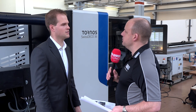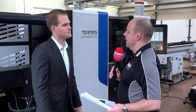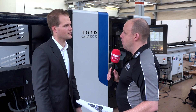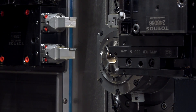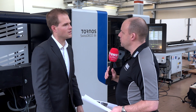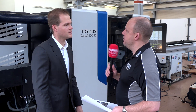You can also put up to four cross tools on the back operation as well. When developing that back working operation, you actually used one of your spindle motors from the main spindle for the driven tools on the back working, so you have a lot of power. Yes, it's the same spindle motor for the counter and main operation, so we have the same power — up to 8 kilowatts on the back working tools on the 36.